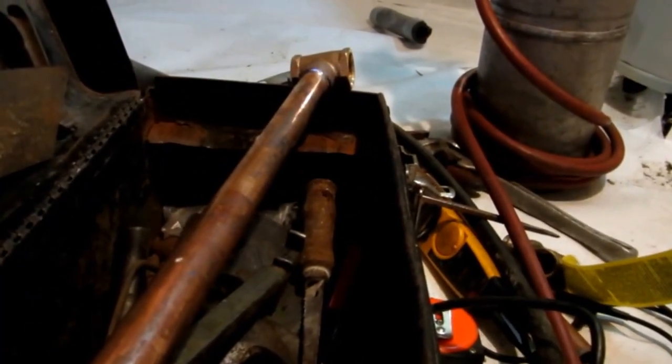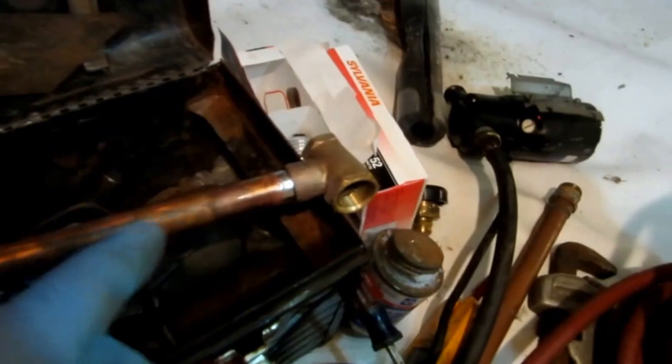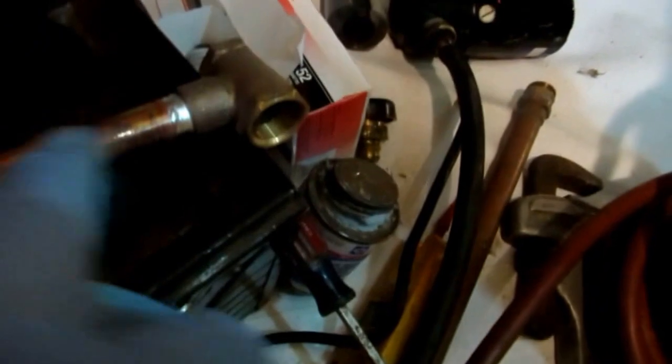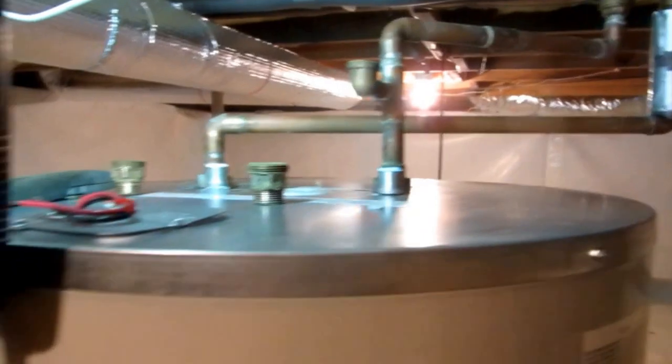On the pipe, you don't want to use the pipe with the red. That's strictly heating. I'll let that cool and I'll cut a piece off. And I'll solder my female adapter. I'm just gonna go on the other side, copper by female. You want to make those cuts, you know, maybe four or five inches. So once that's cool, you can screw that on. It's not gonna heat that thread up. You know, because they'll be piped open and whatnot, and you don't want to do that.